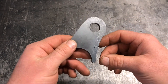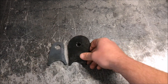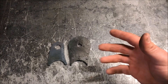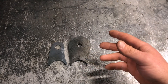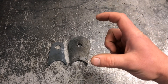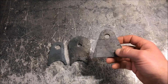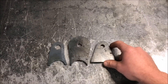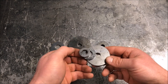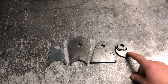We use T1 for 98% of our products. We build all sorts of stuff out of it — shock tabs, link tabs for two-and-a-half ton and five ton axle tech, wheel centers, steering knuckles for the Meritors and two-and-a-half tons, spindle plates, kingpin top caps, plus a whole line of miscellaneous builder parts such as tabs, brackets, gussets, and weld washers for repairing or strengthening holes.